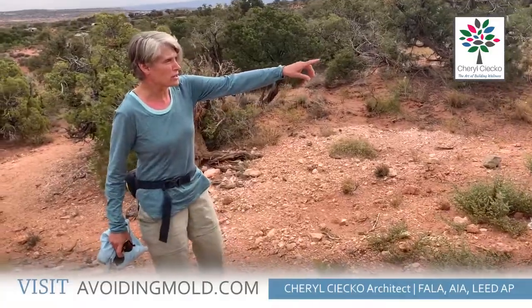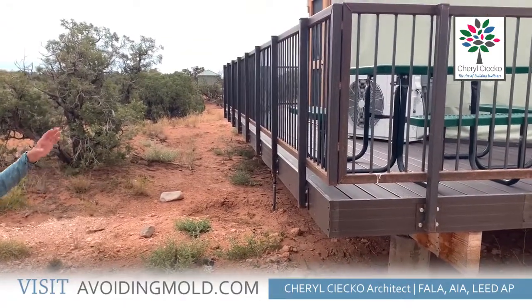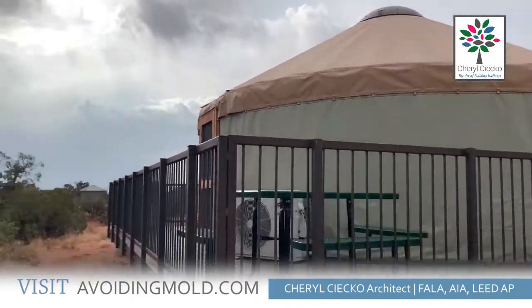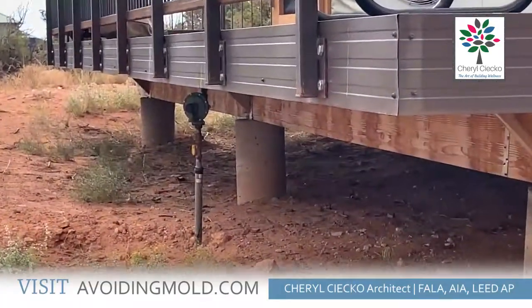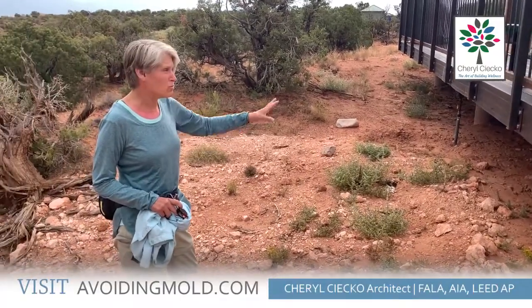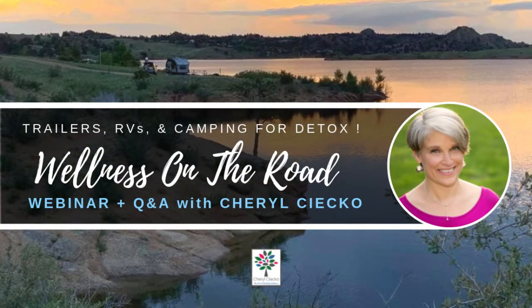The other things I want to show you on this yurt: it has a heat pump. It does have windows that open with flaps — they zip down. It has a skylight; I don't know if the skylight is ventilated but I think that would be optimal. It has a front and back door, and you can see a gas line right there coming up from the ground — so even if you have a propane tank, which is what they have down the hill, gas lines, water lines, and electric lines always come from below. So if you're in a place that's freezing, you won't be able to have any water lines in here because it's completely open underneath. On the other side is an electric line, and they have a gas grill up there — so this is how a yurt works.